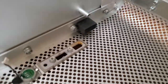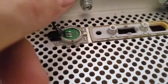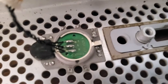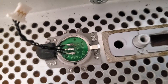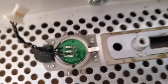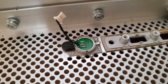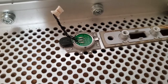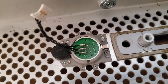The power button has three wires going to it. I believe they're labeled but can't tell. One's going to be for the LED, and I'm sure they all share a common ground — so you probably have an LED positive, a switch positive, and then a shared ground. I'm going to look that up and make sure it's right. I don't want to fry it out because it doesn't look like it changes out easily.